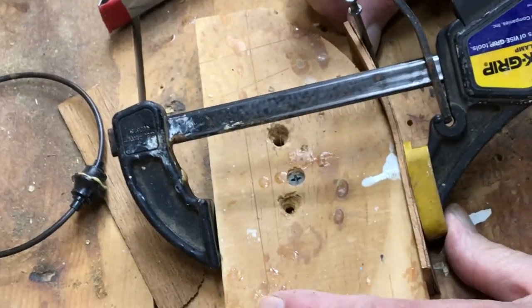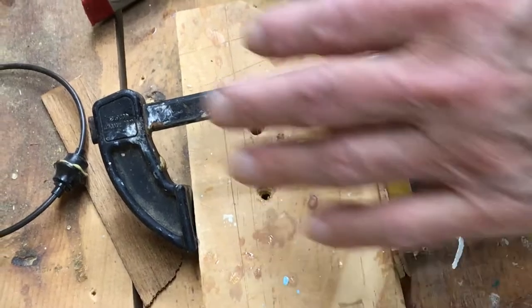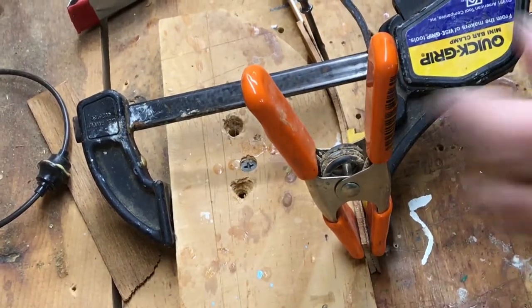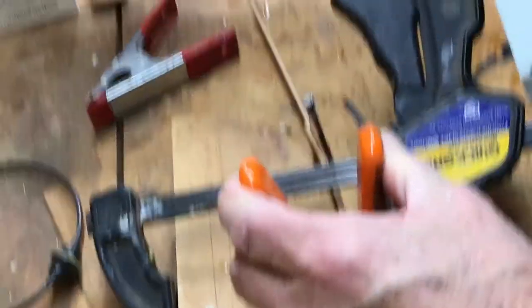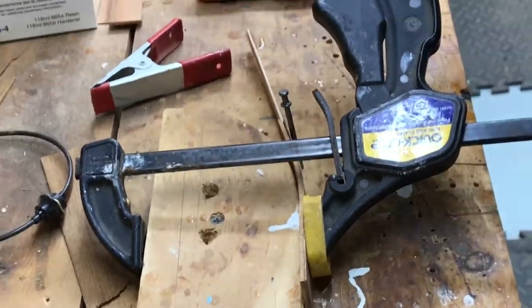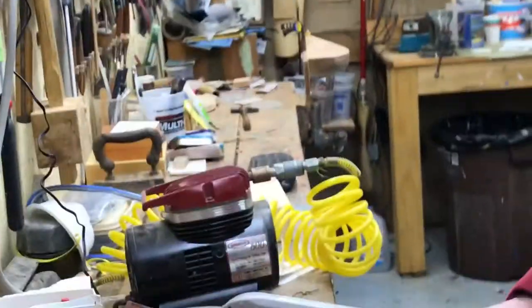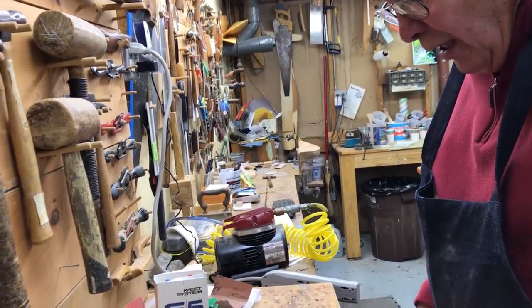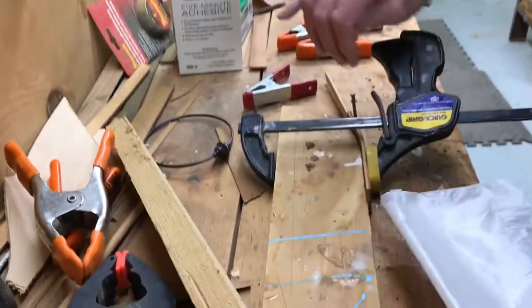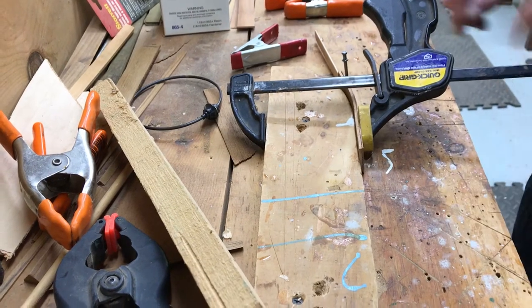My advice: if you're making one of these pulpits, all cat boats did not have them. I just want to put a little more curve in it, so I'll just do that. Then I glue it together. You can use 5-Minute Epoxy from West System, 5-Minute Epoxy from your hardware store, a regular epoxy, a Titebond glue, or any good glue at a hardware store. Just some take longer to dry. I always put a little piece of wax paper down underneath everything so it can't stick to the bench or the form.